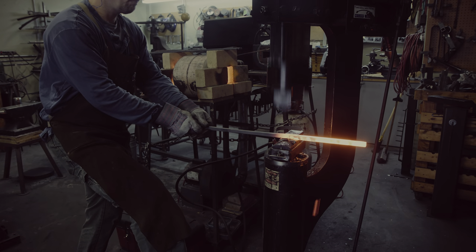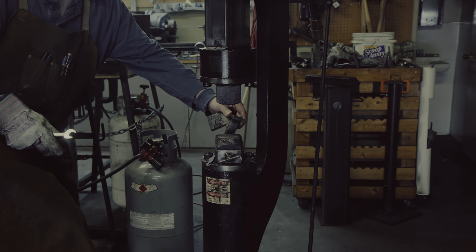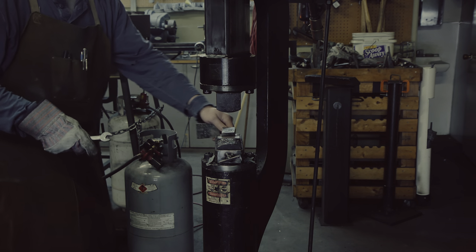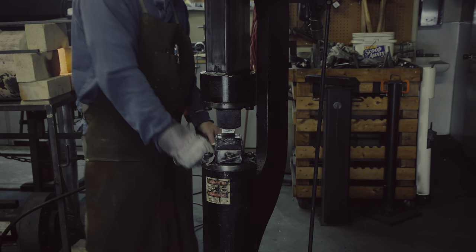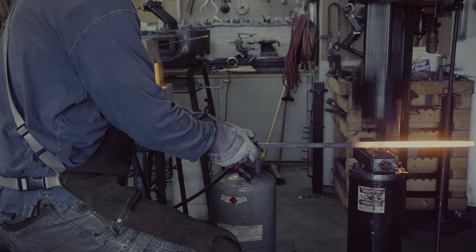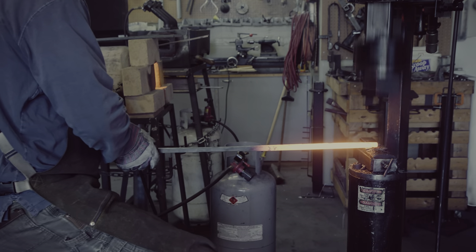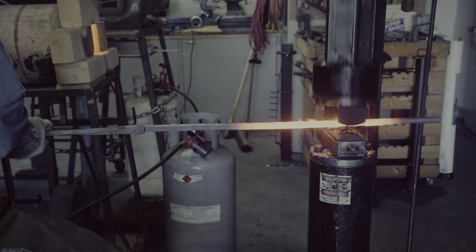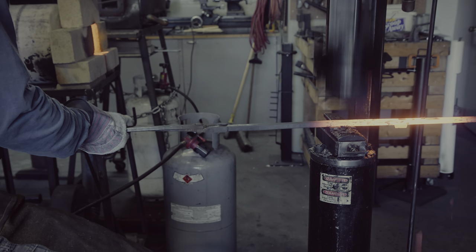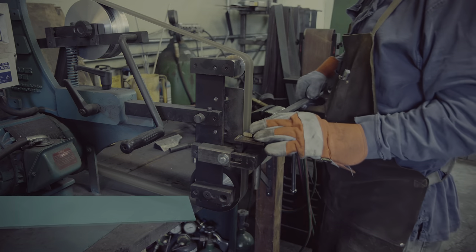After a lot of work, I sometimes give the steel a rest and let it cool down — it gives me a little rest as well. I am now at the final dimension of the billet and will forge it flat on one side to widen it. To help with that, I put a 3/8 inch (9mm) spacer under the power hammer. If you did not watch the detailed episodes, you are probably unaware that what you are seeing here is my fifth attempt at creating the broadsax. After a lot of trial and error, I ended up fixing my forge and switching from wrought iron to mild steel for the back of the sword.